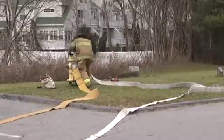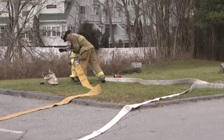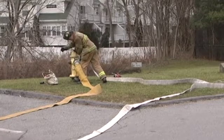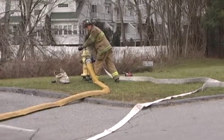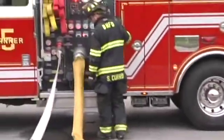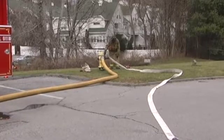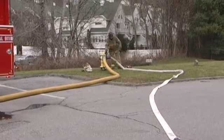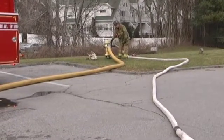We're going to start with our hydrant. Our hydrant man is going to supply water not only to the ladder, but also to this pumper. Remember, we've said right from the start of this evolution that it's very important, if fire ground conditions allow, that you have two separate and distinct supplies of water coming into the apparatus at one time. We realize it's not always possible, but whenever it is, we really want you to avail yourself of that opportunity to protect the apparatus. We now have water to the engine, and the engine company operator is going to supply water to the aerial device.